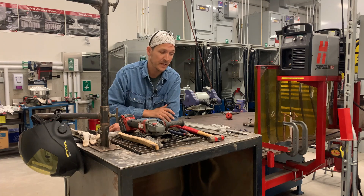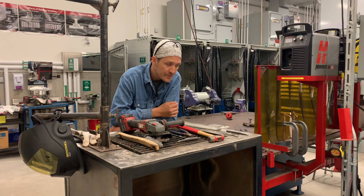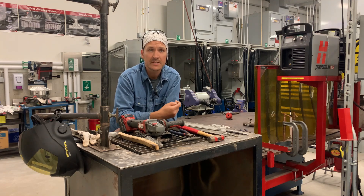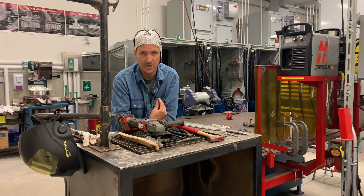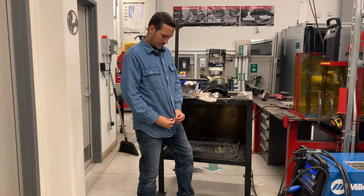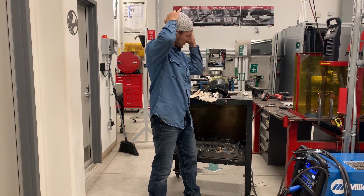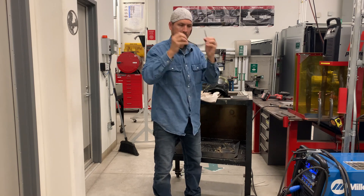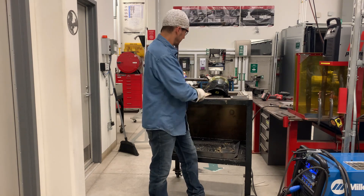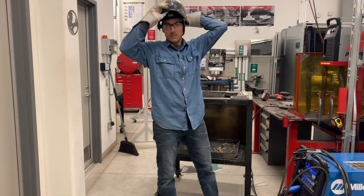I've got a pair of pliers to handle my plate, a chisel and hammer to remove any spatter or leftover slag, and a pick — I'm using an old piece of tungsten here because it's harder than the mild steel itself — to get in there and remove any debris. For protection I've got long sleeves and long pants, dressed in an all-cotton Canadian tuxedo, a beanie to protect my head and ear from sparks, clear safety glasses to protect my eyes from sparks or chipping slag, gloves, and a shade-10 helmet.